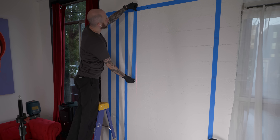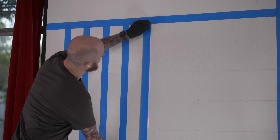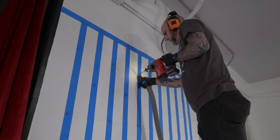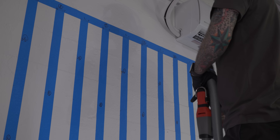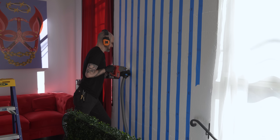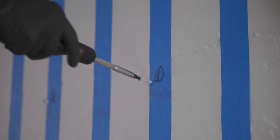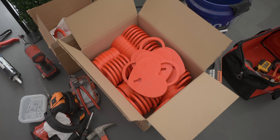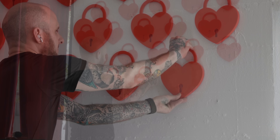Install time begins with the laser level and one of my favorite tools — masking tape. I need to lay out a 10-column and 10-row grid because Ruby wants an offset pattern for these hearts. I've been drilling a lot of concrete lately so I picked up this cordless hammer drill — it's so much nicer than my corded one. Until I broke the only bit I had and had to start again the next day. When installing Tapcons lately I've been putting a little dab of silicone on them. This helps lubricate the threads for easier install and glues them in place a little to hold them firmer in slightly loose holes. Now I have a wall that looks like it has really bad blackheads.